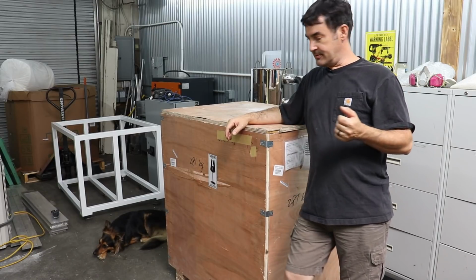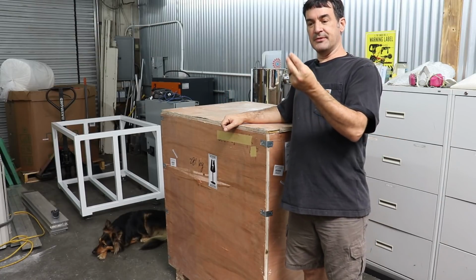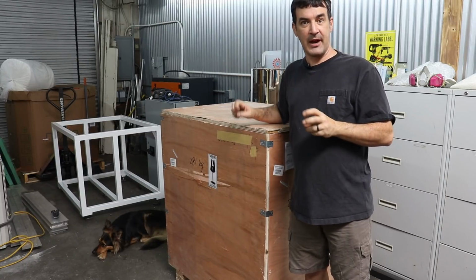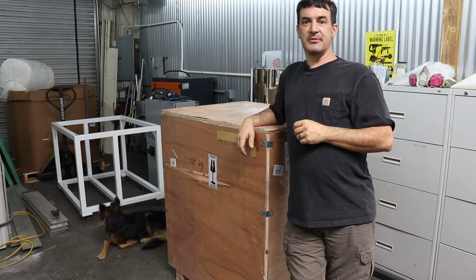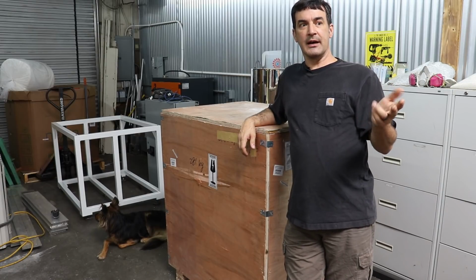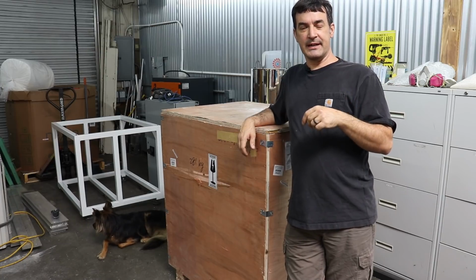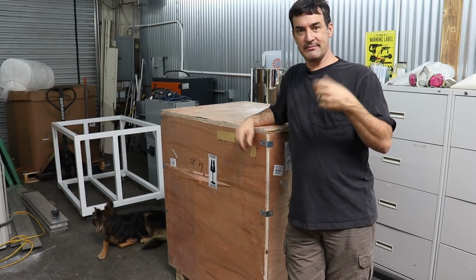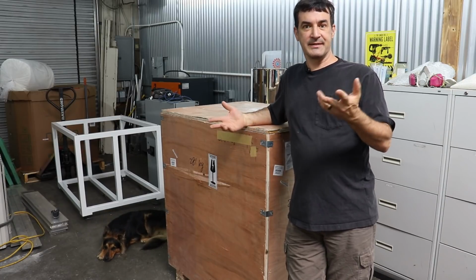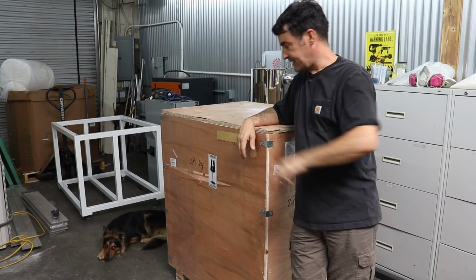So what you do is you grind that plastic up in a granulator down to individual small granules of recycled plastic, or reground plastic. And then usually you mix that regrind plastic back in with fresh, new, clean, unmelted plastic. Typically you can do like a 10% regrind to fresh plastic to have decent parameters or part qualities for the remolded parts with partially recycled plastic.